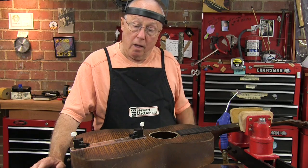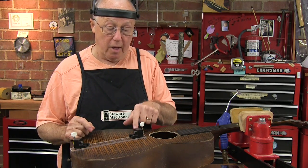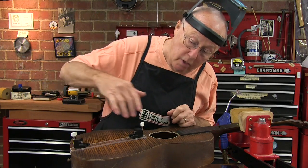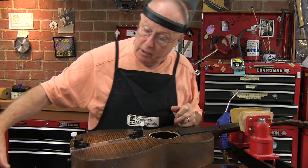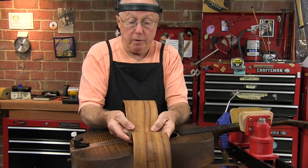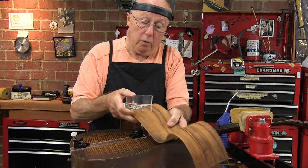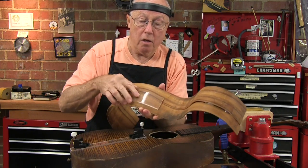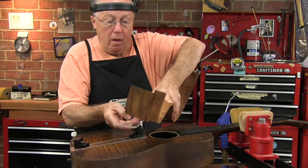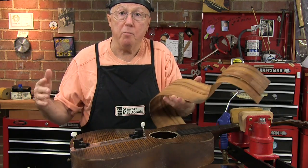This is a tool that can clamp together parts that you can't always reach. You probably couldn't reach that with a sound hole clamp, and you can't use a sound hole clamp on a guitar side at all. Imagine you've got it split all the way down the side — it happens. With a curved caul, and you can heat acrylic with a hot heat gun, you can have an exterior caul that fits perfectly and run a whole line of clamps all the way down the side and pull that side together.